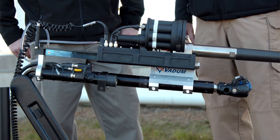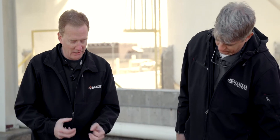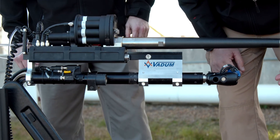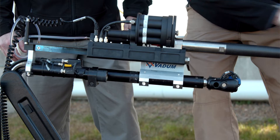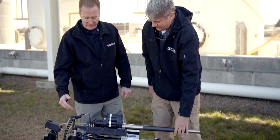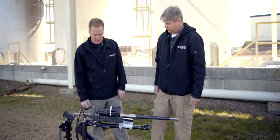How are we protecting the robot from the recoil damaging the arms? When you first fire the shot from this forward position, it'll push back, and the hydraulic will kick in and slow it down. I can push it back myself, but under recoil — when you hit it really hard — it just bites in and won't allow you to go anywhere. The recoil reduction on this system is about a 40 to 1 reduction of what it would be with a pan shot alone.